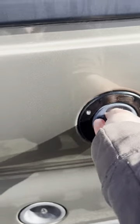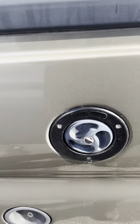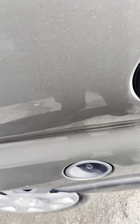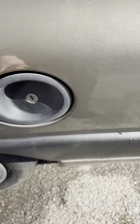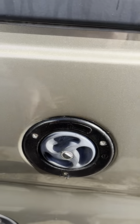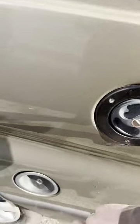Fresh water inlet is this one up here at the top. Make sure you don't get that confused with the diesel filling point down here. You can tell it's definitely the fresh water inlet because it hasn't got the ignition key to unlock it. This physical ignition key is the only key that will unlock your fuel filler cap. Make sure you do not put water in the diesel or diesel in the water — fresh water at the top, diesel at the bottom.